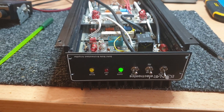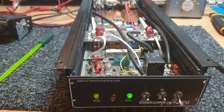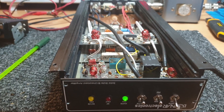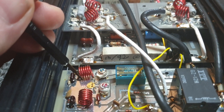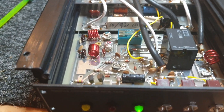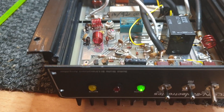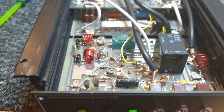You probably noticed on the last excerpt that when we took the preamp in, the signal actually went down. A little trick with Lunar amps and a lot of these high-gain preamps: if they've been sitting around for a while, most people will think that the FET has gone — and look, it can be that, don't get me wrong — but often it's actually the alignment that's come out. This amp hasn't been used in a very long time.